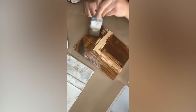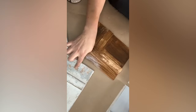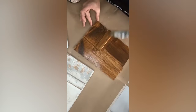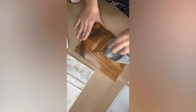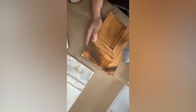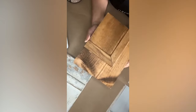If you have a painted piece, you can milk paint over it, but you want the underlying color to look like wood. I recommend either sanding it down to the original color, or using an Amy Howard one-step stain. The colors I like to use for a base coat when it's not real wood are Windsor or Java — Java can look very natural, like an aged pine. We're going to wipe out the excess and then dry it, because we're going to get our gesso on.